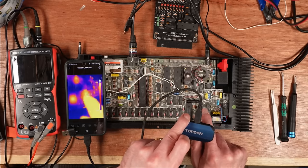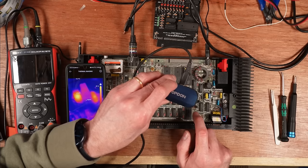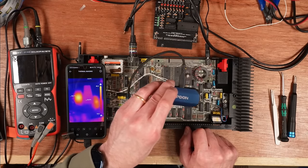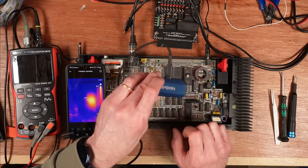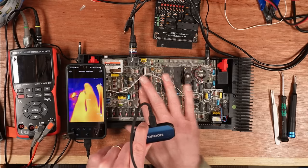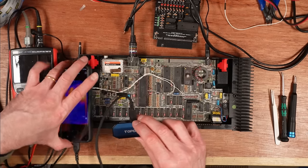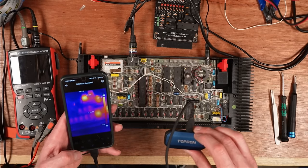It's drawing 890 milliamps and I've got a couple of hot spots. The voltage regulator is at about 26 degrees — barely above room temperature. One of these chips is 32 degrees, a PAL 10H8CN chip has a nice glowy spot but it's not hot, the ROM is not hot, the Z80 is 50 degrees which is fairly normal for a chip from '86, and the Mega ULA is 55 degrees — not a problem. And all of the RAM is stone cold.